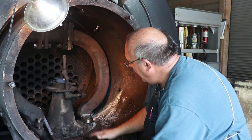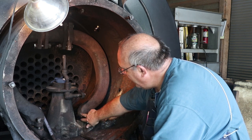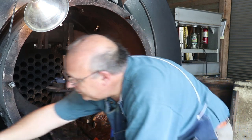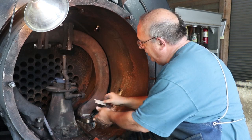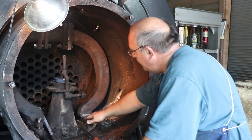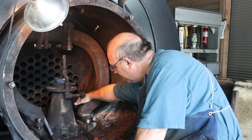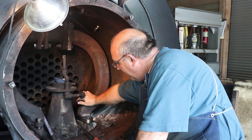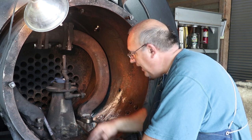So I have gone in and made some measurements on all four corners, basically measuring from the bottom up. Down here I put some little adjustable parallels in there. See one of these little things here that slides up and down. So I did that on each corner and got a measurement, so I know how much off I am. Basically I'm gonna use the lowest one or the highest one, whatever you wanna call it, as my zero. And when I get this back out, I'm probably gonna use the grinder. I'll put a line around here and we'll get that relatively flat.